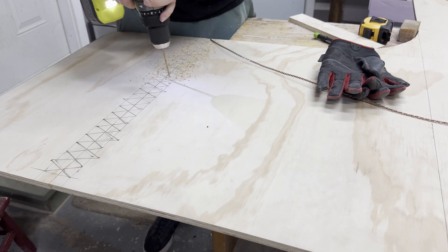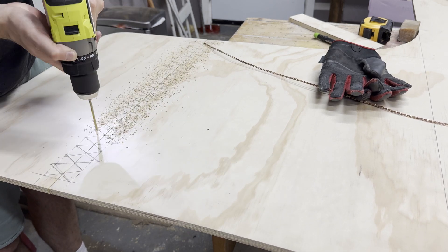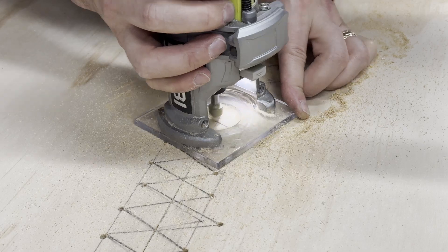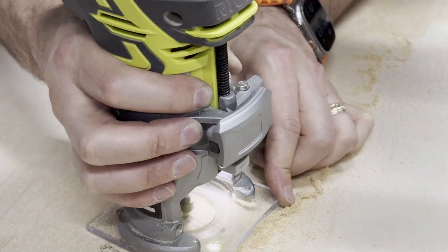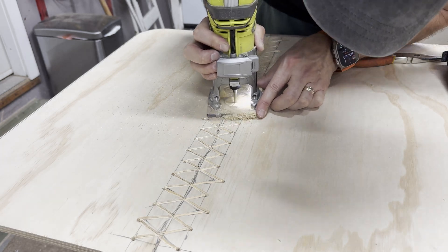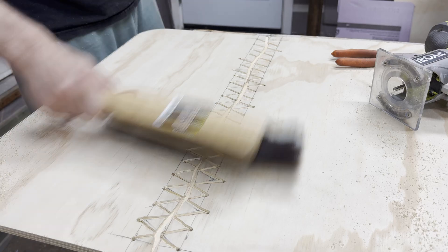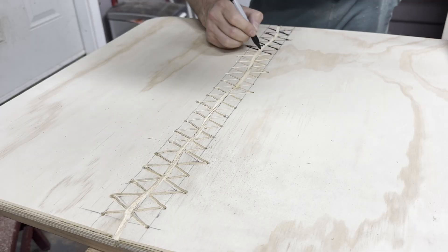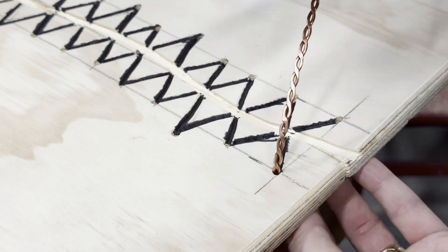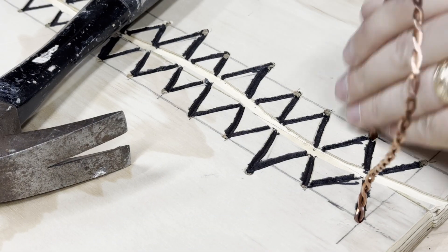Then it's back to preparing the wood. First I have to drill all the holes, then I'll go back with a router to create a small relief where the path of the wire is going to go so it sits flush when done. Then I'll carve out a small channel that will be filled with resin. The table is going to be stained black when done, so before I add the wire I'm marking out all the channels to make sure nothing gets missed. Then it's just lacing up the board the same way you lace your shoes, except with a hammer.